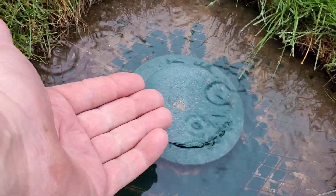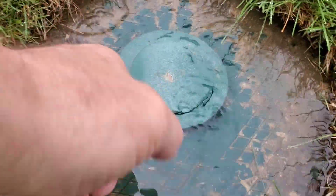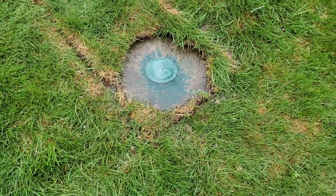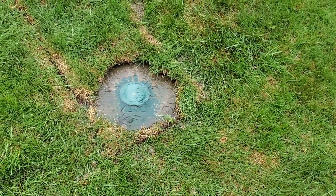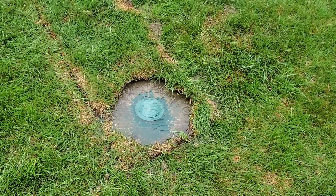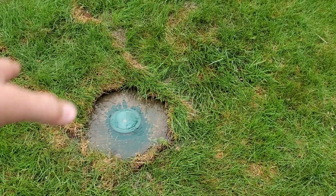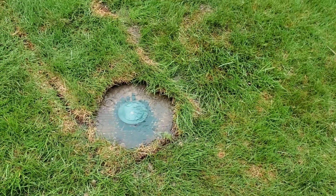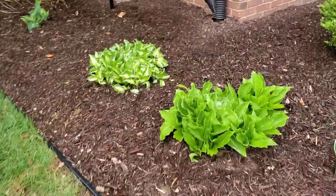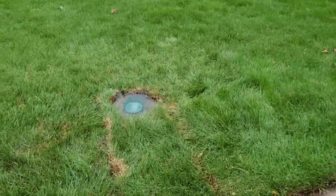In the spring, of course, this has picked up a little bit and water's just running out. The turf restrictor plate keeps the grass from growing over this. That's the only thing that makes our drains last forever — the fact that we put in a turf restrictor plate. Because the grass just grows over these, then they can't daylight water, then your system fails. And what do people say? Look, it's plugged. No, it's not plugged. The grass grew over the end and it can't daylight.